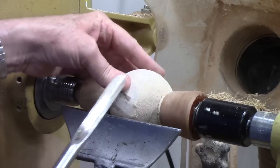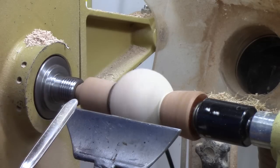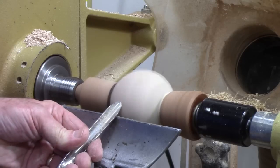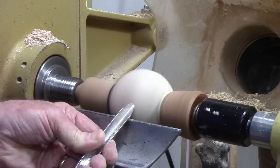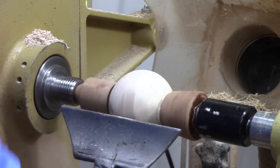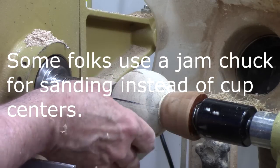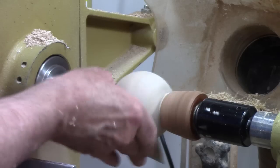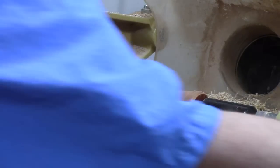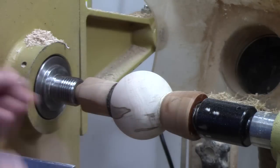You could turn these balls between centers and not use a chuck. If so, you'd have to remove something on each end. A fast way to remove it is to make sure you've got it centered and then just trim it up on the end where there's a ghost on it. Turn the speed down. Just hand paper moving, then change directions — rotate it about 90 degrees the first time and after that just a little. Proceed through the various grits.